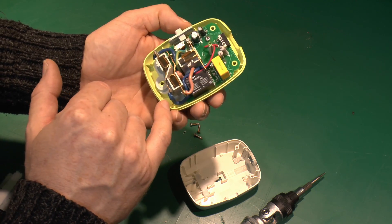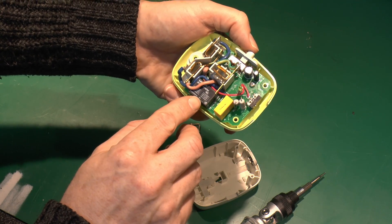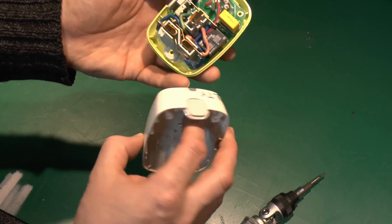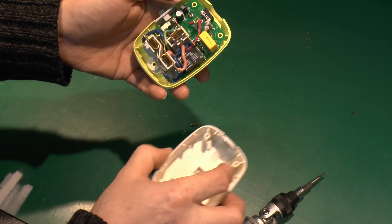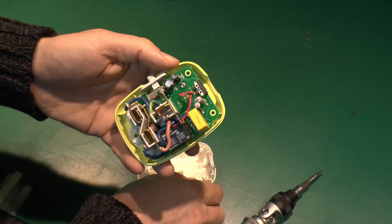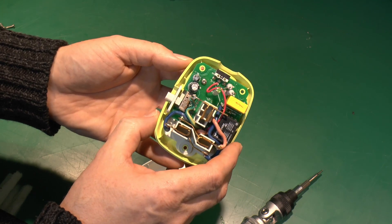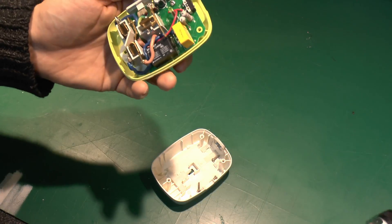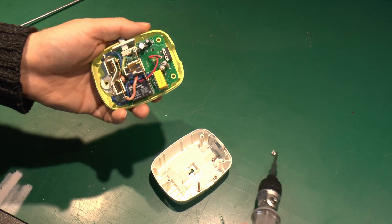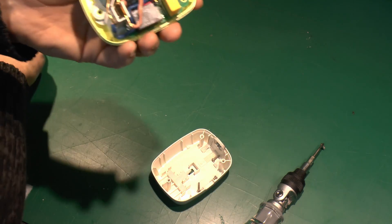Let's have a peek under there — that's presumably the relay which does the actual switching. There's a little LED to light up on the front, going through to this plastic piece here which just moves the light up towards the top. There's a little button on top pressed on a plastic tab in the case, and on the side just a slide switch for the three time settings. Holding in the blue there's yet another one of these stupid triangular fasteners to come out — entirely pointless, but that's what many manufacturers seem to like using.